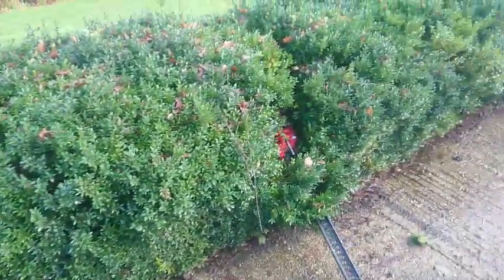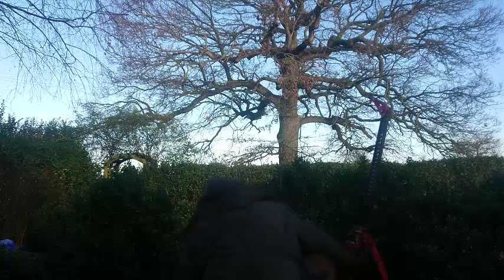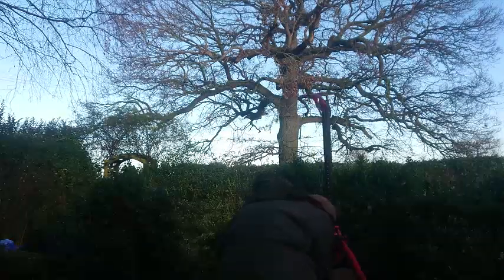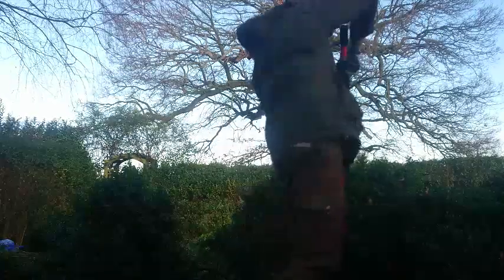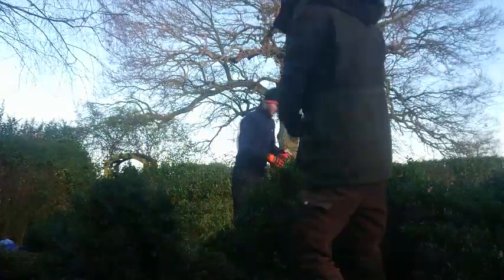Good morning YouTube. I apologize for the lack of footage — I wasn't intending on actually making a video today. I just thought I'd briefly show you how I use a farm jack for removing stumps and a bit of hedgerow. This is actually some box hedging we're taking out. I've already taken out a couple. We're quite lucky because there's a concrete slab where I've got the base of the farm jack. Normally across the bottom you would have a large bit of timber bolted to the bottom.